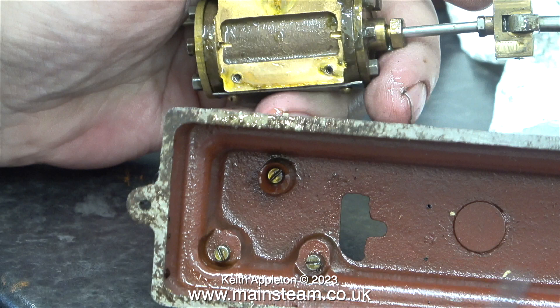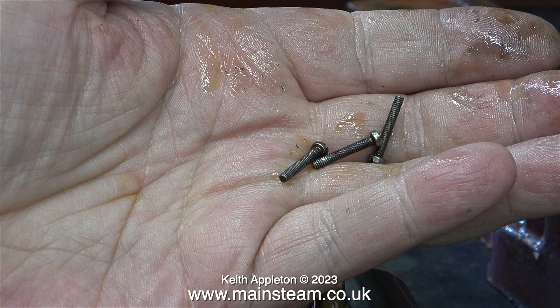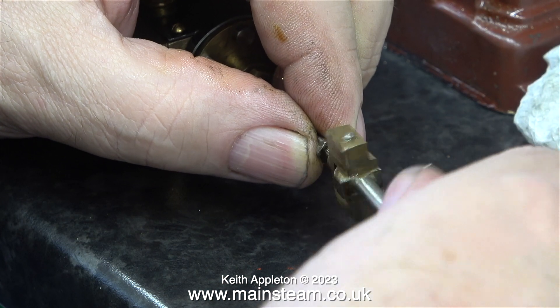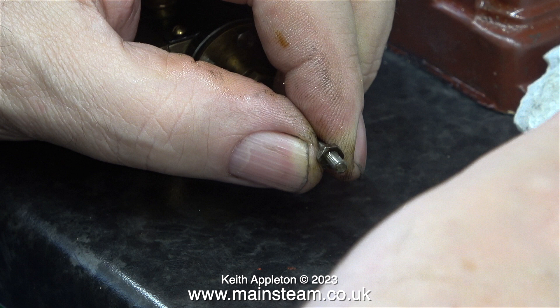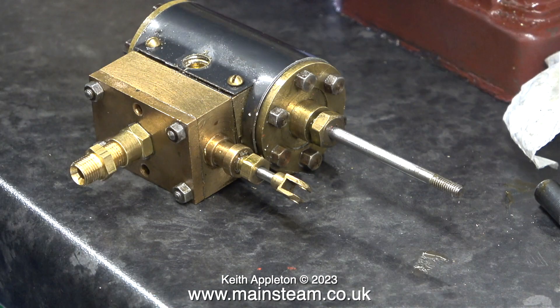But I did eventually remove them — you'll see it in a future episode. Back to this engine, and the three fixing bolts for the cylinder are now in my hand. I do wish that the original designer had specified larger bolts; these are very small, and when fitted back in place they need to be quite tight as well. It's time now to take the piston out of the cylinder. To do that, I have to separate the piston from the crosshead, remove this lock nut, then remove the cylinder end cover and remove the piston entirely from the cylinder.